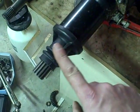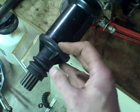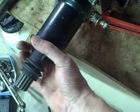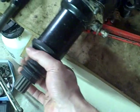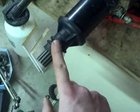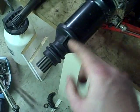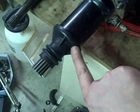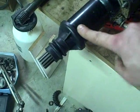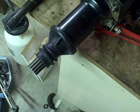This is what it looks like, and it's actually just a push fit — it pushes on here. It doesn't even fit the outer diameter; it kind of acts like a shield. When it's pushed all the way on there, it spins with the shaft and will help keep mud and water from getting in there. It's an extra little bit of protection for that seal I installed behind here, so that's a good thing to have on there.